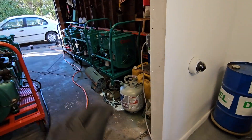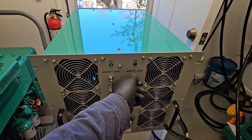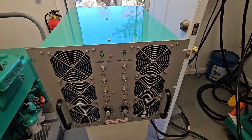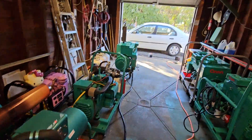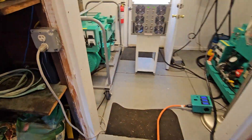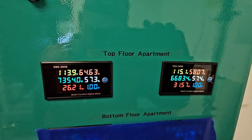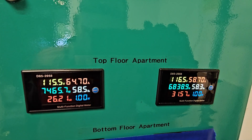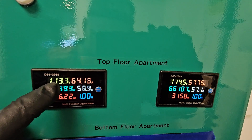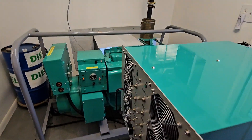What we're going to do right now is turn on the load bank. We've got a few thousand watts right here, and we've got up to about 10, 10.5 on here. Right now I'm running full bore. She's working hard! That's what we got. I think it's running good — 64 amps on one leg, 58 on the other. 7,249 watts on one leg, 6,800 watts on the other leg. I just whacked it, man.